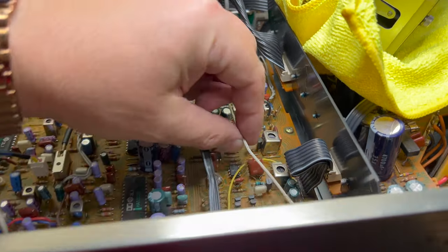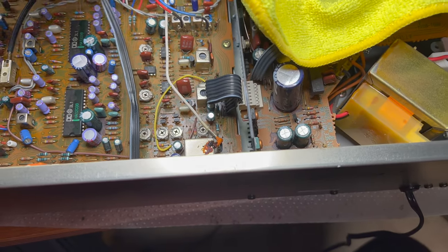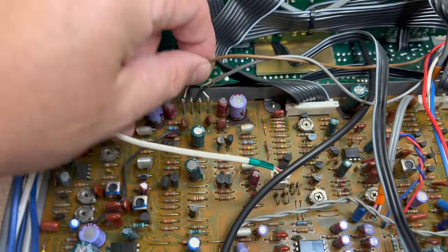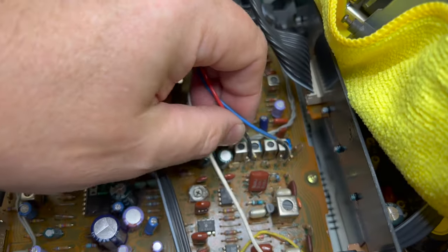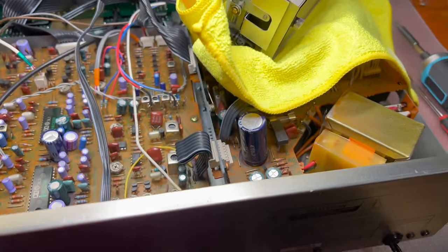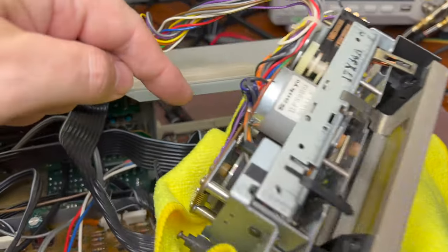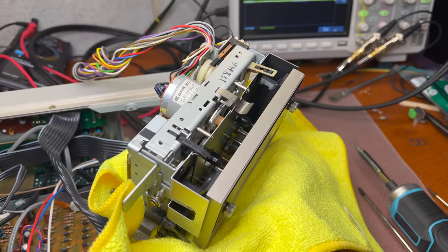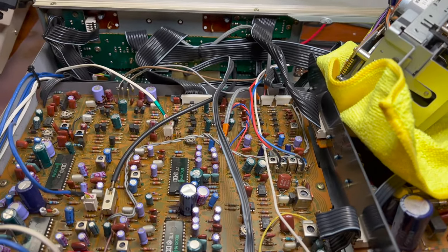Here is what I found: both the playback head and the record head, as well as the erase head, are wired and soldered. I will have to carefully unsolder this to be able to remove it completely. You see, just these two connectors go to the tape transport; the other two go to the front panel with the buttons and the flat cables. Let me unsolder and I'll see you there.